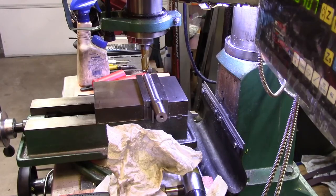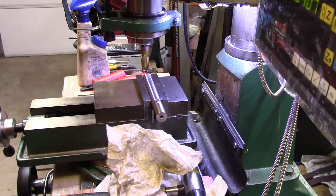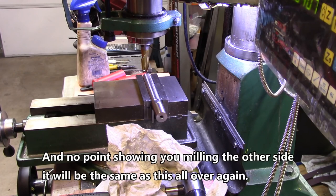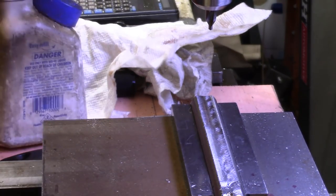Now we'll just move right straight on into working on that mill vice stuff. Here we are another day — it got kind of chilly last night, they said it got down in the 40s. It's about 70 now but still got a cold wind. I think I'll go down 60 thou and that'll be plenty wide enough that I can roll it over and do the other side. I'm going to let you guys sleep through that because there's not much entertaining about watching an end mill zoom back and forth.